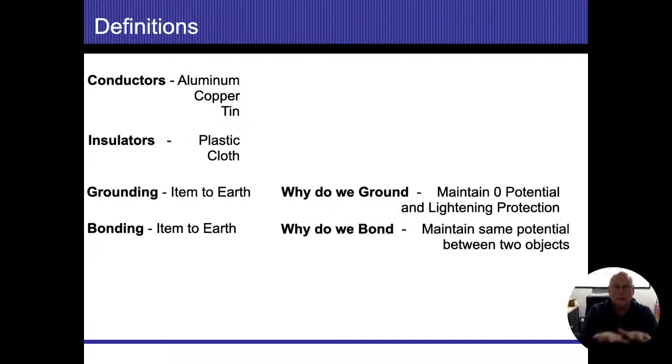So anytime I have a difference in voltage, electricity will flow. But the earth is also a big resistor. Resistors limit the amount of electricity that's going to flow. Now, there is an ohm test and everything else. I'm not going to get into that because I think it just complicates things too much. At 120 volts pressure, it's easier for me to remember that somewhere around 5 amps will be flowing into that earth.